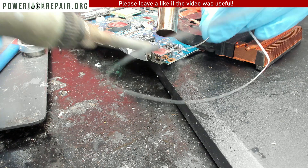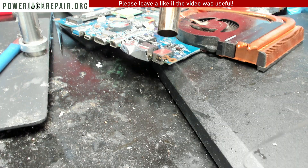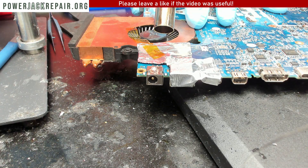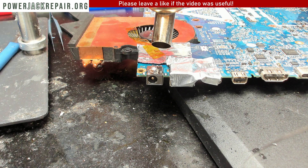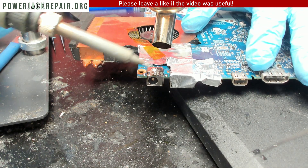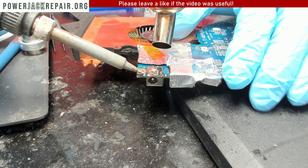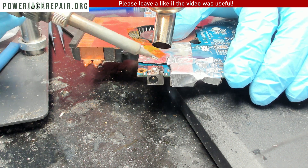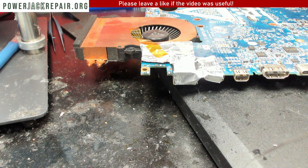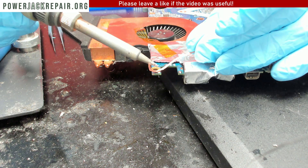What I want to do is add some solder on this end. We flip this over again and boost up the temperature a little bit more — it will warm up the motherboard much quicker. The heatsink is still attached to the motherboard, and when it is it dissipates the heat from the motherboard really well, which is one of the reasons why this connector doesn't want to come out as easily. So we want to remove the heat and get all the solder off.